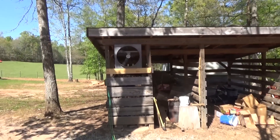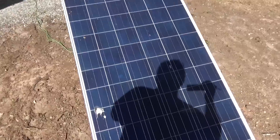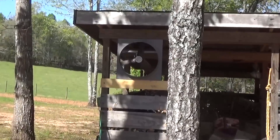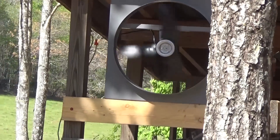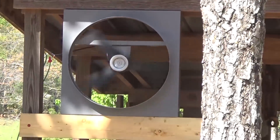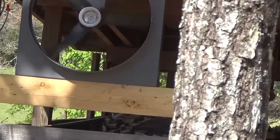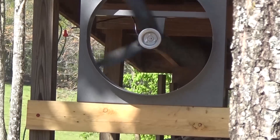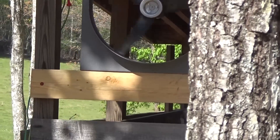It's kind of late afternoon now, and you can hear the change in the fan. I'm just shading it — step out of the way and she cranks up. So you can get away with about 100 to 150 watts of solar. This is a 300-watt panel, which isn't necessary for this — a good 100-watt panel would get the max RPMs out of it.